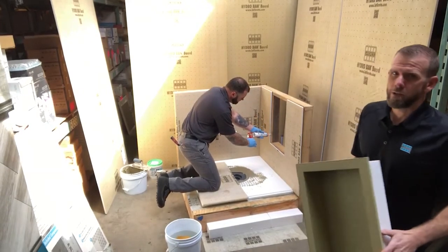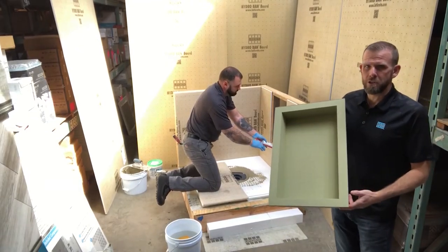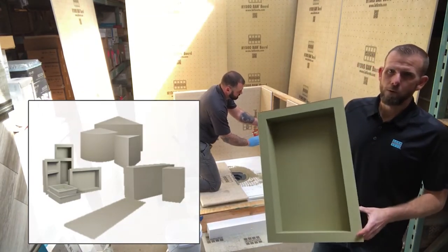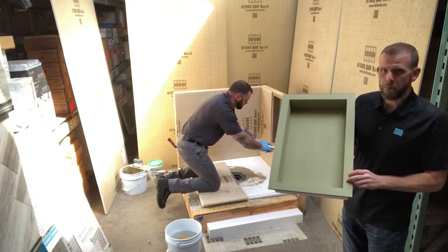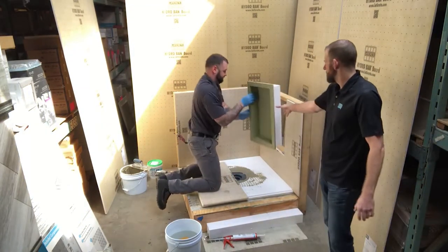All right, we're going to talk about a couple of our components. For a long time, we've had preformed, pre-waterproofed niches, benches, a bunch of accessories, overlay curbs, ramps, extensions. We've got a lot of preformed, pre-waterproofed accessories to go along. I'm just going to show you how easy it is to drop one of our niches in. So no fasteners required. Basically just a bead of adhesive and sealant around the back. Glenn's applying, stud to stud.